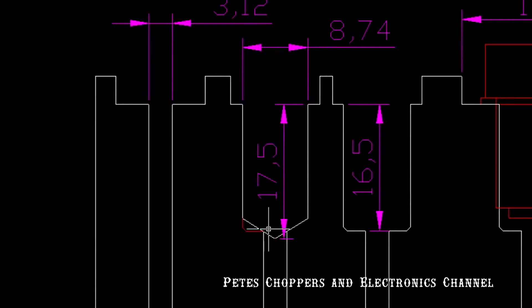Taking into account the angle of the drill, I want to come down exactly 17.5mm. To measure from that land, I place a penny, a coin, or a blank washer in that hole. I bring the drill point down to touch the disc or coin, zero the Z-axis, remove the coin, measure its thickness — let's say it's 2mm thick — compensate for that 2mm, move the quill down another 2mm, and it will be perfectly in line with the land. Then I can zero the axis again and go down exactly 17.5mm.